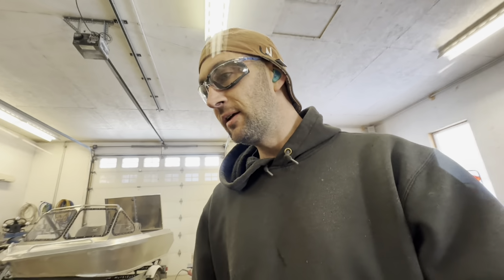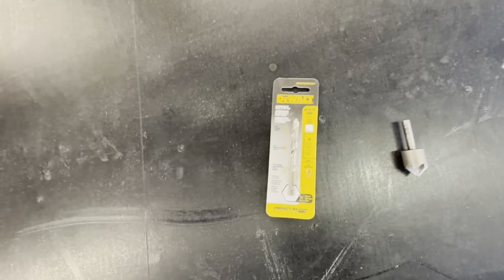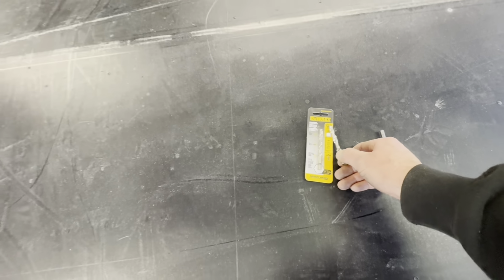The guy on the bottom is gonna be holding the bolt there. So what we're gonna do, and he used quarter inch, which is kind of good because now I can use the 5/16ths drill tap. You can get these on Amazon or your local Home Depot, whatever. 5/16ths by 18 is the same thread pitch as the hardware that Jetstream recommends.